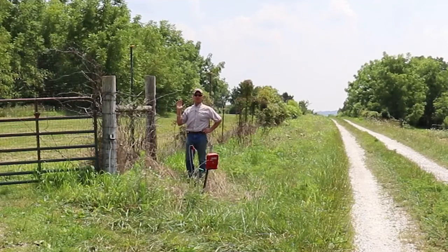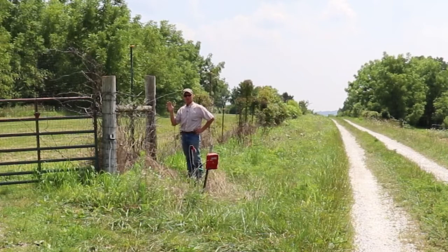These tall T-posts are available, but they're a special order kind of thing. So if you're thinking you want to make a tall fence, and I would highly recommend that if you're serious about keeping deer out — that's a must. Look into those, and I'm sure you can order them at most farm and home supply places throughout the state.